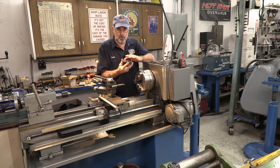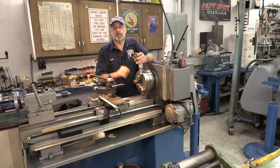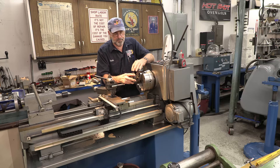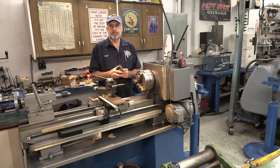I may have to take a stone along one of these sides. They feel pretty smooth here, but I want to make sure I'm getting that in the face as well. I'm also going to indicate the machine surfaces on each side of the bore to make sure they're running true. I can verify it there and by pin, reaching in between the jaws three-point at least, to know I'm running concentric — because this gear is second in line on the shaft and I don't want it to be lobing.